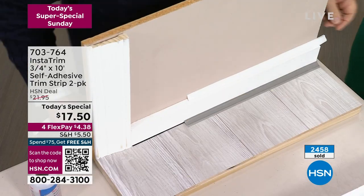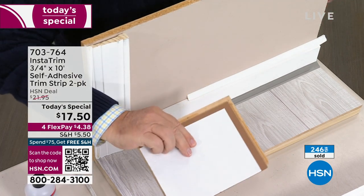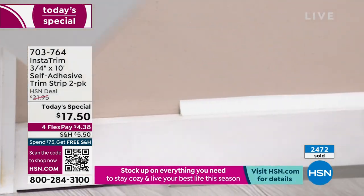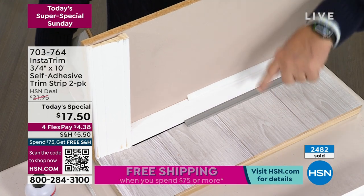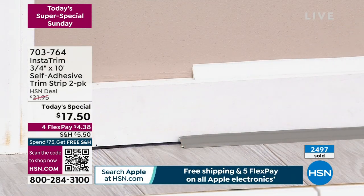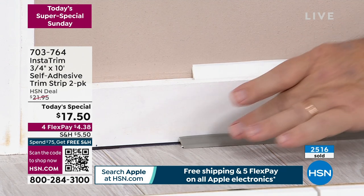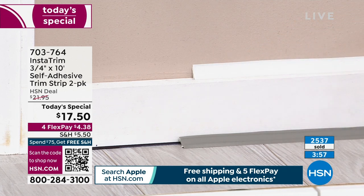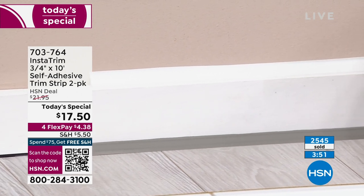We're seeing uses around windows — anywhere you're getting wetness or a breeze coming in. This is exactly what I have in my home: a laminate floor with a foam back. Sometimes the foam is separate, sometimes attached, but whatever it is, it moves — up and down. Put a heavy piece of furniture here and the floor will actually compress, giving you a big gap between your baseboard and the floor. So what I did: I put in the flooring, used a piece of 1x3 plain white lumber, put the gray strip down at the bottom to match the floor, and the white strip up top. It turned that piece of 1x3 into beautiful molding that will never separate from the wall.